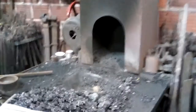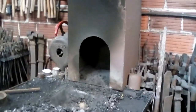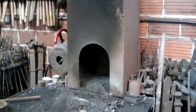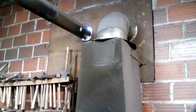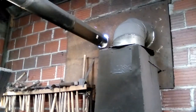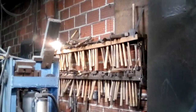The hoodless forge is one of the standard patterns for hoodless forges, which just basically requires that you have an opening that is roughly 1.5 times the area of the flue pipe. So I have a 12-inch flue pipe, and you need to have enough of a smoke chamber to allow dust and other things not to go up. But that's a 12-inch pipe, and you can see a regular stove pipe going out through the plate in the wall next to it. The racks of swages and hammers.